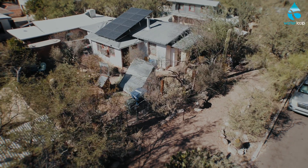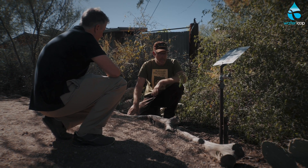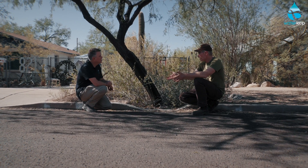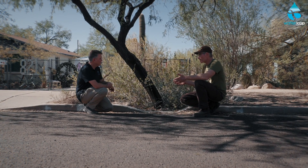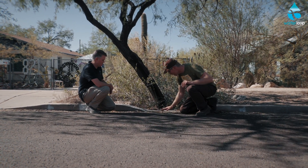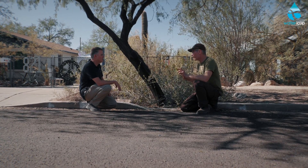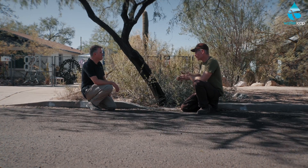All the organic matter here is just leaf drop from the plants — we don't rake it up. When we prune the adjoining vegetation, we cut it up and put it here as well, so it's all free. All up and down the street are curb cuts. Where neighborhoods don't have a driveway dip, we started cutting the curb to create a water inlet point. Water comes down the gutter, fills the basin, freely irrigates the vegetation, and once filled, backs up and the surplus goes to the next basin — a little innovation we call a backwater or eddy basin. Water flows in, fills up, then backs up on itself, so there are no erosion issues.